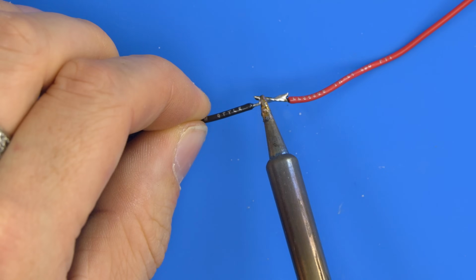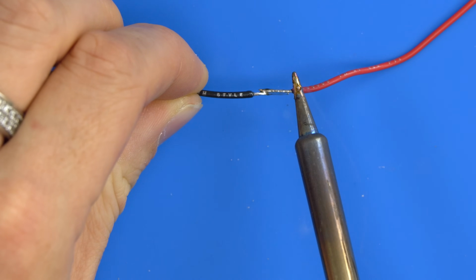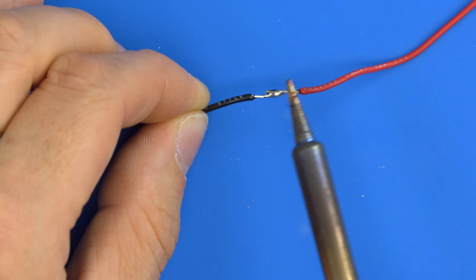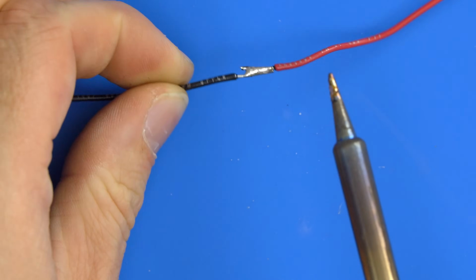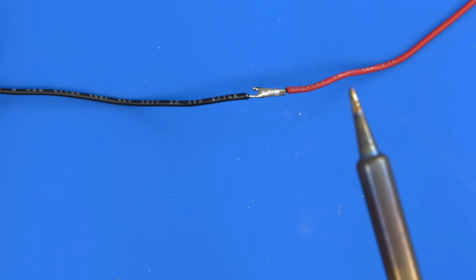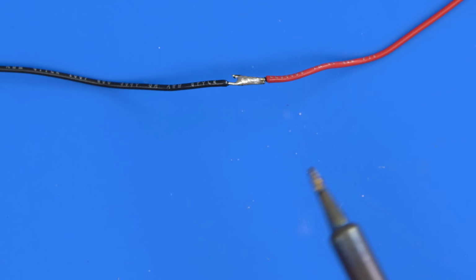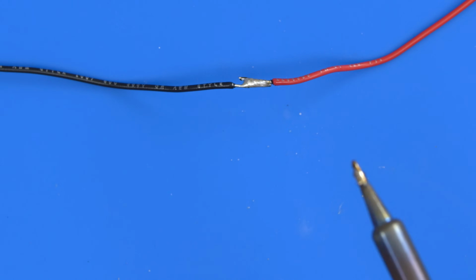And then if you want to try and align them better, obviously you can hold one wire like this and warm up the other, and get a joint. And you can keep going. Again, the longer you go though, the drier the joint will be, so you'll have less working time. But because I'm using the leaded solder, we can go for a few attempts before the solder starts getting dry. So that's one joint. That's the simplest way of joining two wires together. So now I'll show you a few more ways and a few more different wires and join them together again so you get familiar.